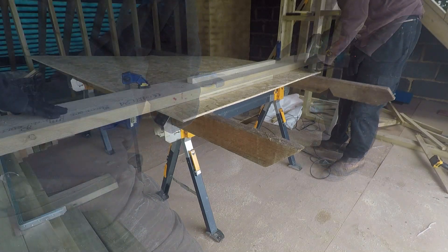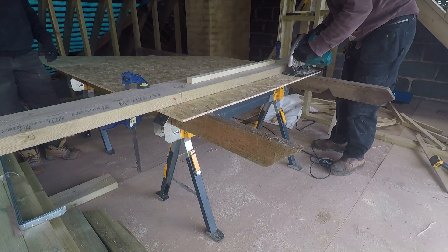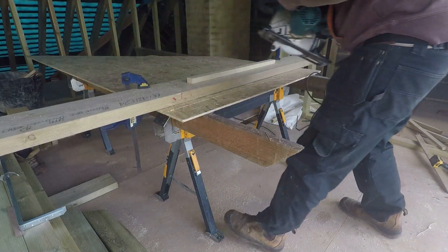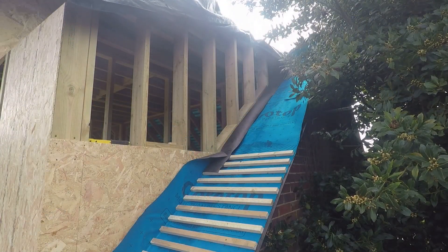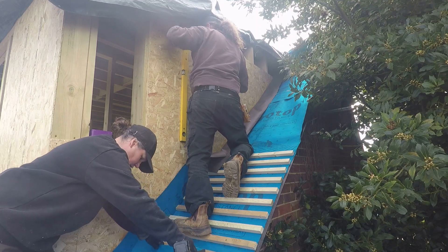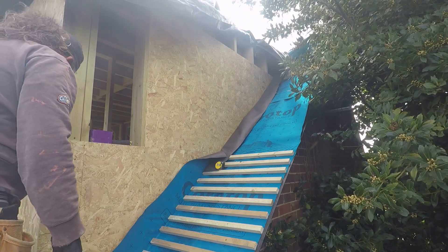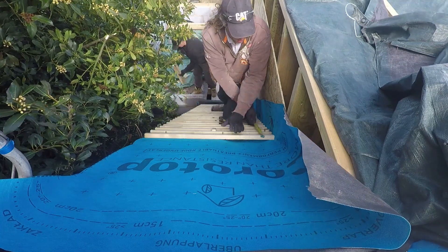So we're back to re-spacing battens all the way down the remainder of the roof. As far as the cutting is concerned we use a rip saw with a nice straight edge - the straightest piece of timber we had. Quite fortunately the batten makes a nice spacer between the blade and the edge of the guide on the rip saw. Then we use a straight piece of timber just to rip across. With the top battens out of the way we can get in that piece of OSB, marking up for the screw holes. Then the rest of the battens can go back into place.